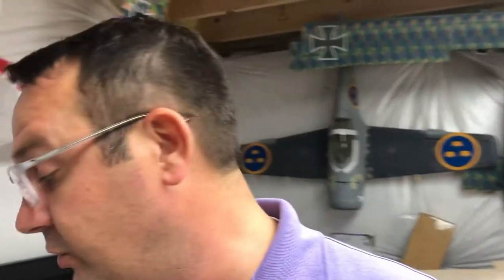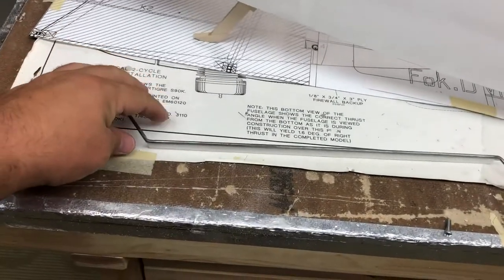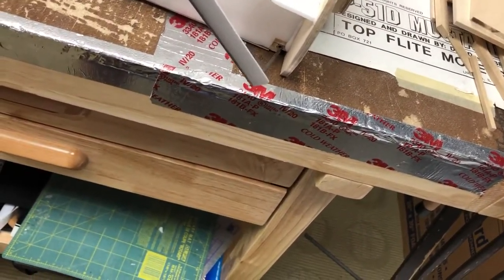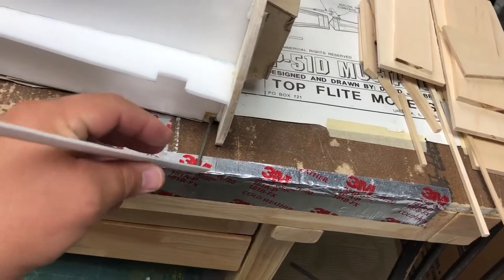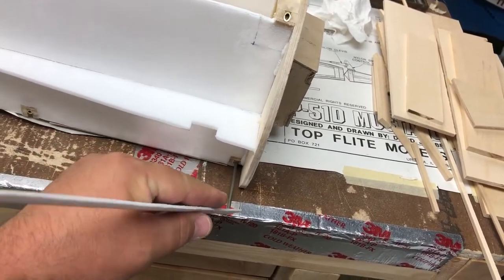I also had to work out on the struts how to glue stuff - you're going to have fairings. This is a strut that has a fairing. The short end goes on the other side because of how the strut faces rearward. This is going to fit in here, notch into here, and poke through the skin - that's how that assembly goes. That's why things are getting a little complicated and slowing down, because I'm having to work through some of these little details.